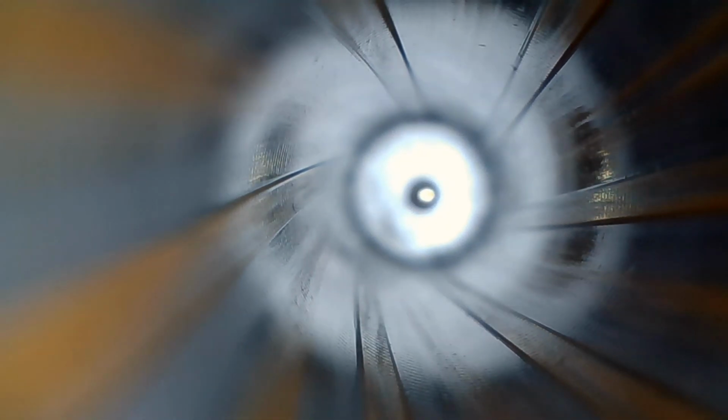Now, in this view I've cut down a patch and put it on the jag, and I'm pulling it out ahead of the borescope. But it gives you a little better idea of what the texture and the surfaces of the lands and the grooves look like. And you can see the machining marks. The machine marks are both in the groove as well as the lands.